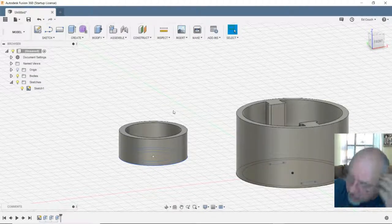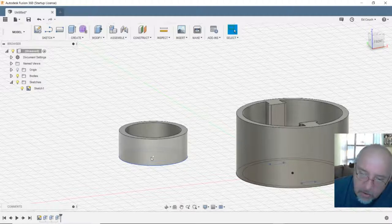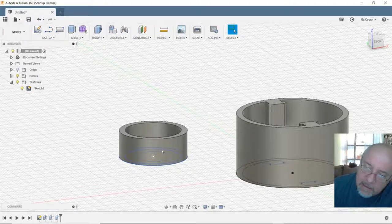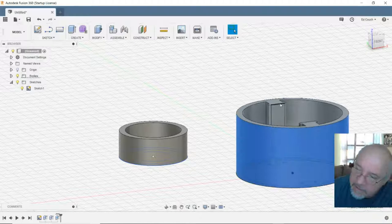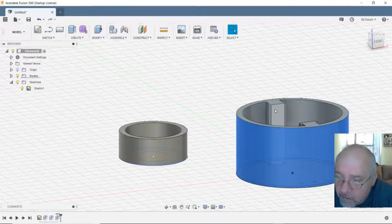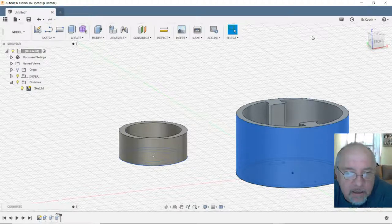Like I said, height-wise, I've got 145 millimeters to play with. So this is dedicated that it is going to go on the top of the lead screw, which is 600 millimeters up from the motor. So that's a given. That has to stay there. But what I'm hoping to do is take this object here and raise it up and then run bracing from it to that, because this is going in my T-slot, and the T-slot is where my wheels are going to run. So the more I can raise this piece, the more clearance I'll have for my carriages, which I have not designed yet. So I'm just trying to think ahead.